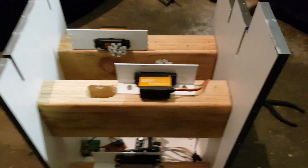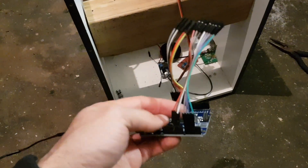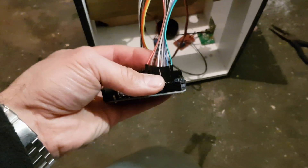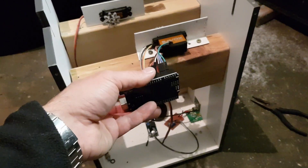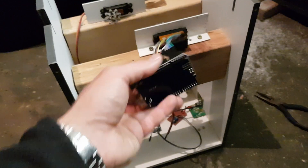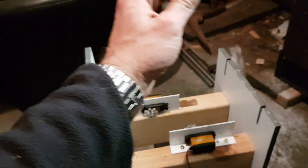Now I've achieved very smooth movement of the levers. I'm using an Arduino which I programmed myself to control that. It's a simple PID controller program which runs to move the levers by controlling the servo speed in whichever direction it needs to turn to achieve the desired setpoint for the levers.